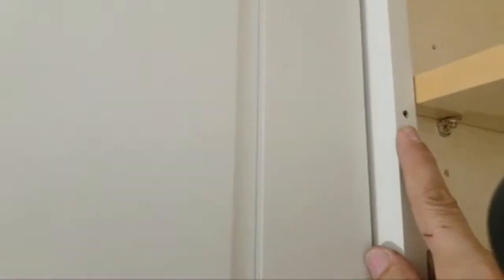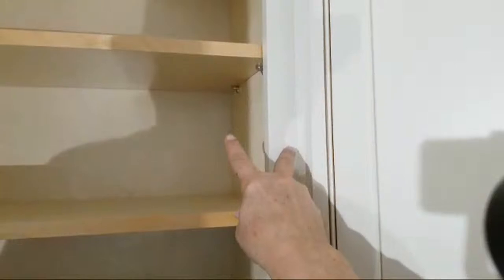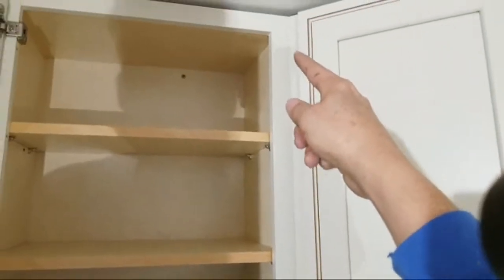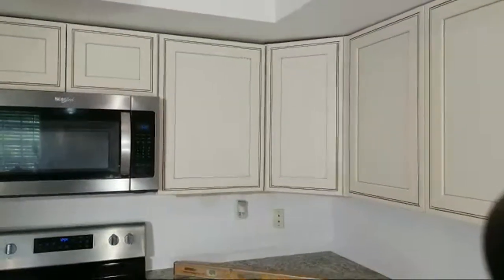See, here's the little teeny tiny fasteners that we use, with a fine thread and a square tip. And so that's how we assure that these two cabinets with their factory edges will pull in tight to each other and stay snug. If you see people who have a gap or the hairline gets wider and skinnier, you know they did a bad job installing. That's why it takes us so long. It takes hours for us to get all this done there.